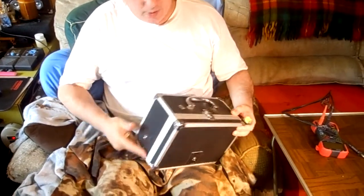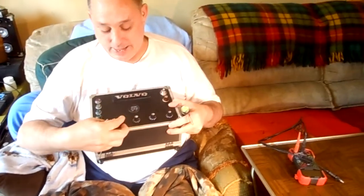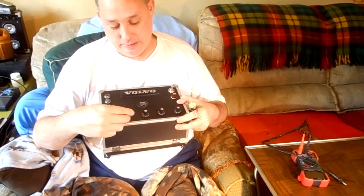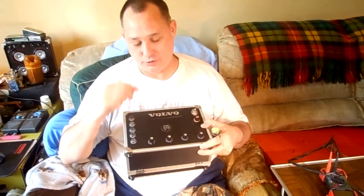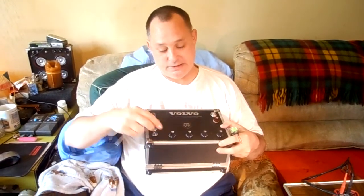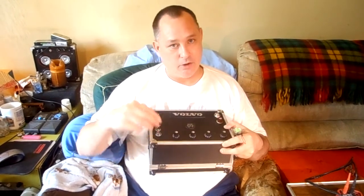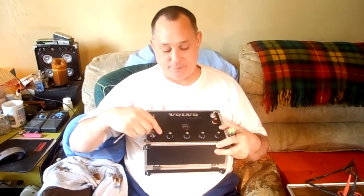If you think of it as a powered speaker, you can run a power adapter over here. On the output of the EQ I keep it at five, right in the middle, but you could turn it to send more — to reduce the output that goes to the LED circuit. If the LED circuit is always dimed, if it's too sensitive, you could put it over on seven or eight and reduce some of the gain of the signal going to that. And that's what the purpose of this knob is.